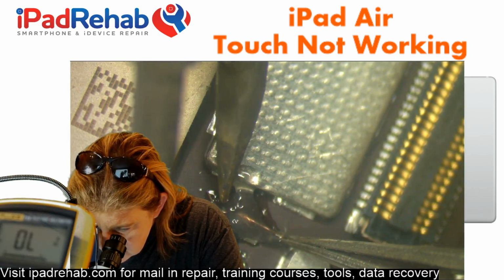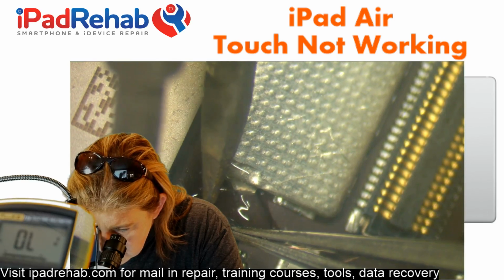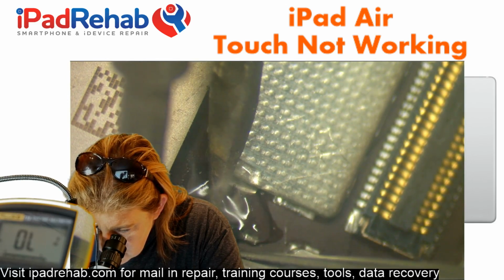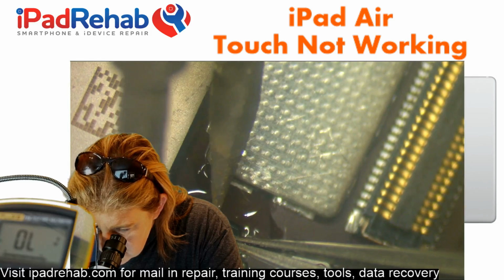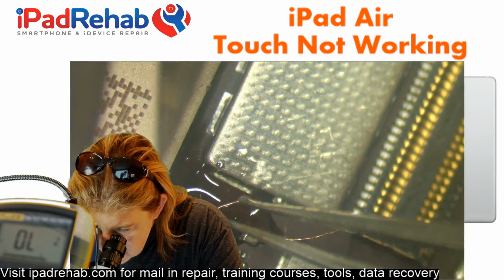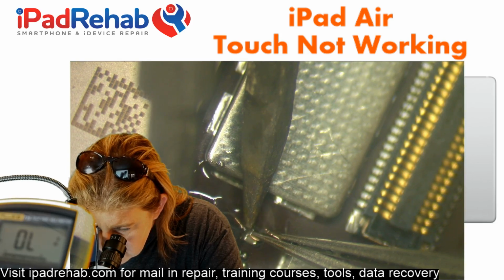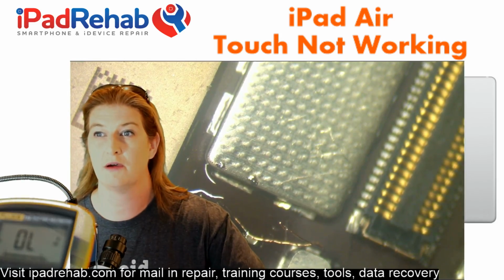So we'd have to test things like different conditions and battery life. But who knows if this is even going to work. This is really just investigational right now. It may not work at all, because there's some higher reason why the enable signal is missing, because there's more of a data line problem with touch overall, and it's not a power problem. The missing power may be the symptom of a broader inability to detect the screen or something like that for touch. I don't know.